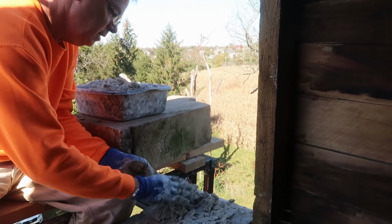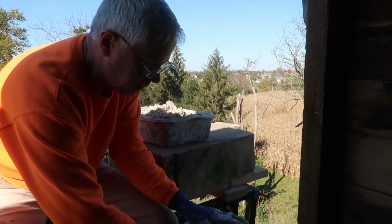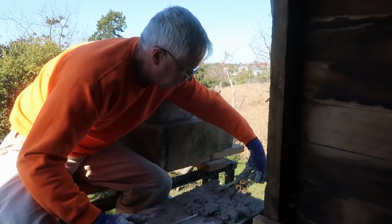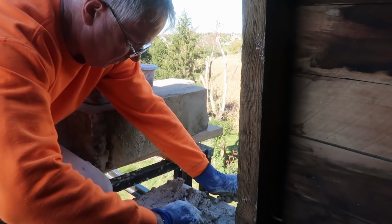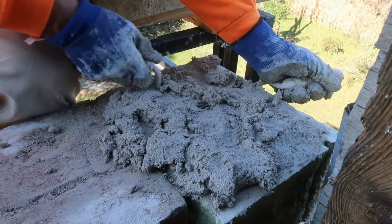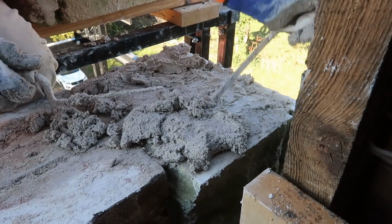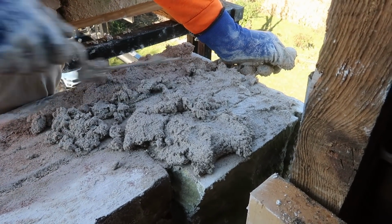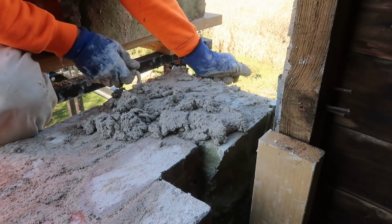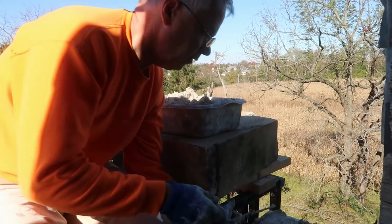I'm gonna see if I can put this down and then trowel off some of it, and then I'm gonna try to see if I can put this here. To get your mortar lines? Now I have to get it flat. And when it goes on, since this is a 1/2 inch pointing trowel, then I'll have a 3/8 of an inch. Once it settles down a little bit, then we should have almost flat the first time.